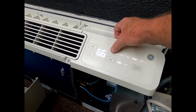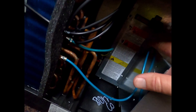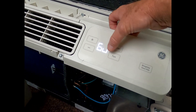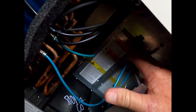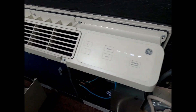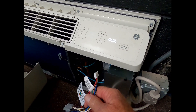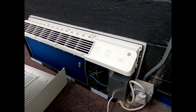So we're going to go ahead and set this for wall thermostat. We'll hit mode, let it go off, then go in and hit the aux switch, hit mode again, come up to six, turn that U upside down, then hit the aux switch again to set the remote wall mode — and there it is. Now the wall thermostat is going to run this PTAC unit. Hope that helps. We're going to move on to the Amana in just a minute.